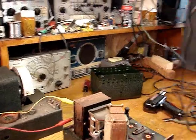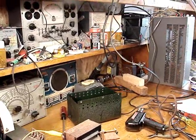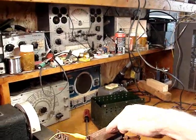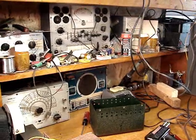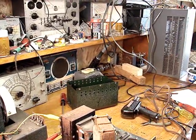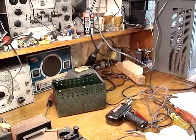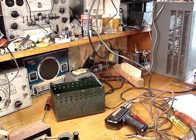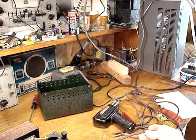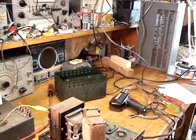I'm pretty much done analyzing the power supply. As rusty as these transformers look and as cruddy as that resistor looks, it reads right at 1,000 ohms as it should — all the power resistors in this thing are good. The power transformer is working: I get 520 volts on the high-voltage secondary and 5 volts for the number 80 filament. All I basically need to do is replace those four electrolytic capacitors — they're low value. I also need a new power cord, although amazingly this original cord is in good enough condition it could potentially be reused. So that's the analysis of the power supply of this radio.